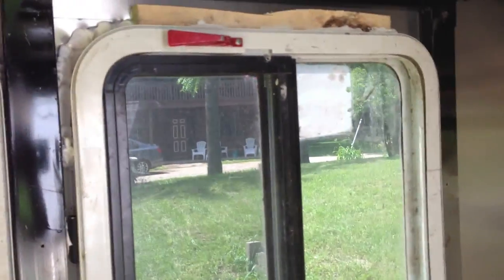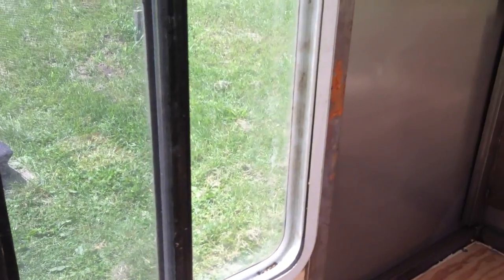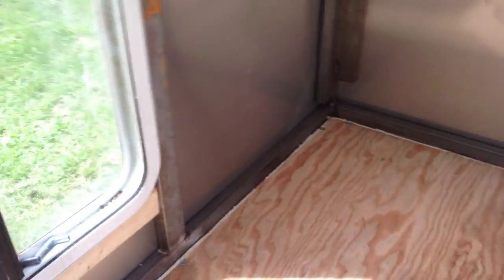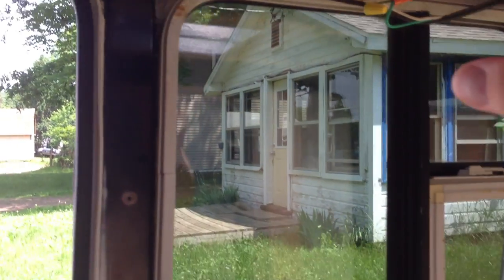At this stage I'm doing the final caulking on the inside of the windows — a nice thick bead around the windows to hold them in place, keep it from leaking, and to hold the siding in place and keep everything together firmly. I ended up breaking one of my windows and had to do an emergency door because I didn't have the same window I had bought. I also have my electrical for the air conditioning run. I'm going to put in a junction box up here for a light above the door, another junction box over here for an electric outlet, and that runs all the way through the wall and pops out right at the bottom of the trailer.